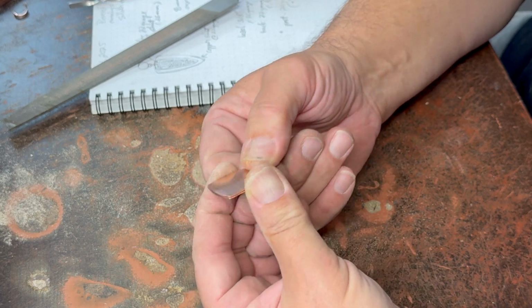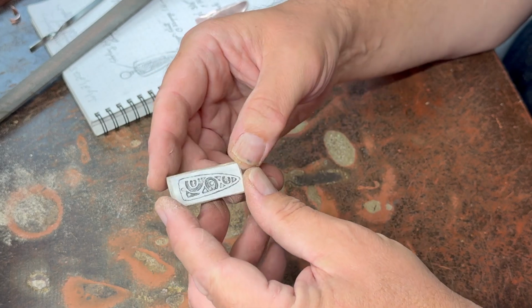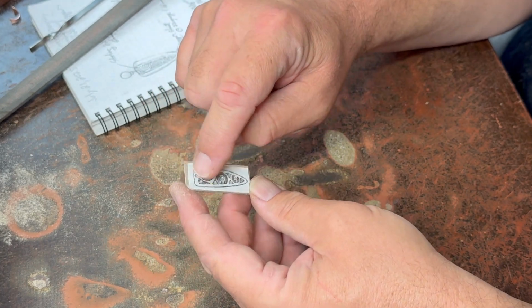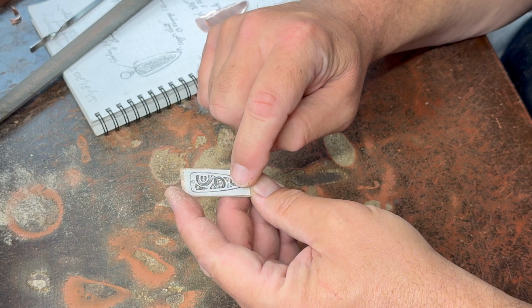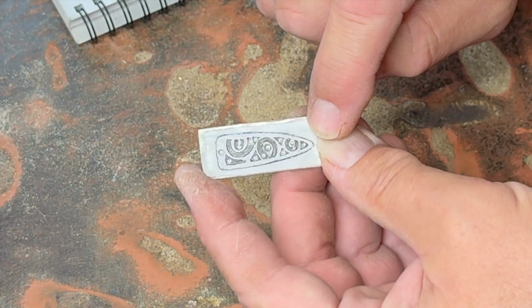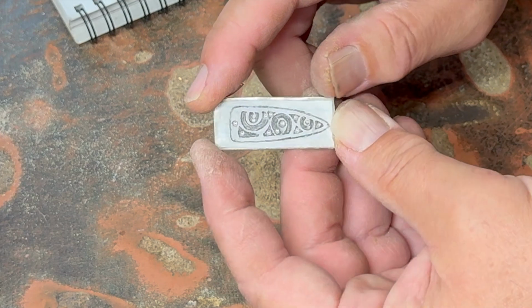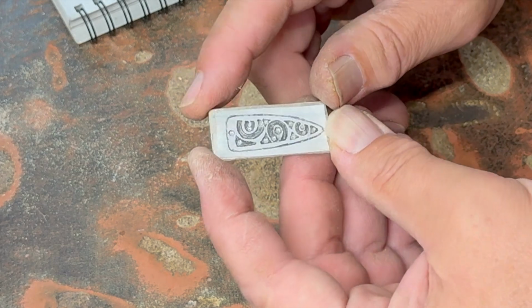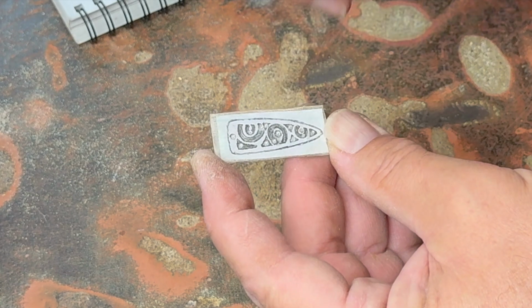That's probably close enough. So remember I had those two pieces of 22 gauge silver super glued together, and then I went ahead and super glued down the piece that I had traced off of this, and I colored in the parts that I'm going to cut out. And then rather than center punching to get the hole started where I'm going to drill, I used a little tiny ball burr to just carve a little divot in the spots where I want to drill. That deforms the metal just a little bit less. I don't remember who told me that advice, but it was a good piece of advice. So thank you to whoever told me that. So we'll go over there and we'll drill some start holes, and then we'll start sawing and see whether my sawing skills are up to par today.